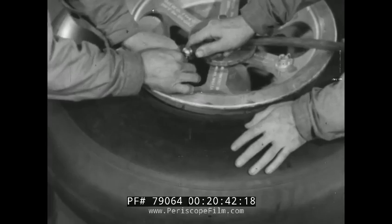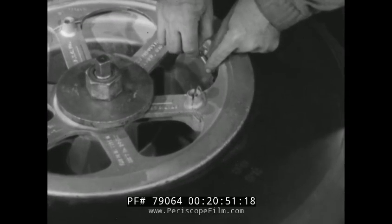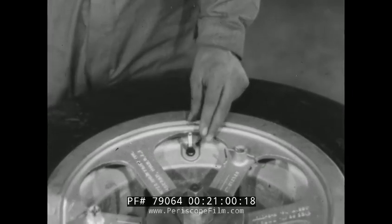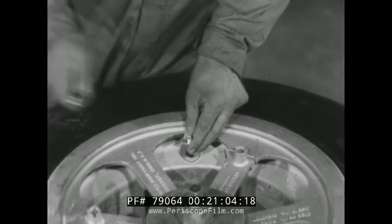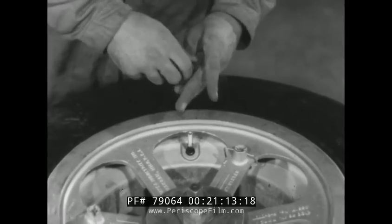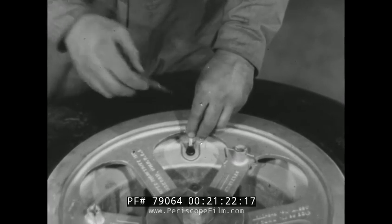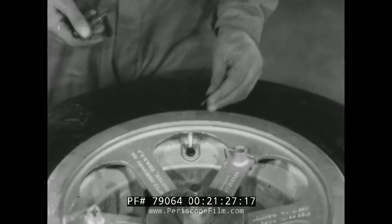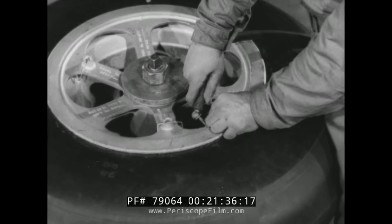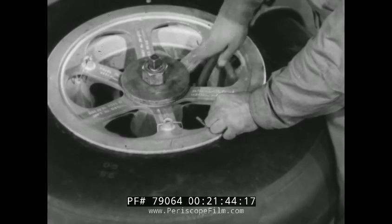With the extension removed, the tire is ready to be inflated. The core housing is unscrewed five turns and the tube is inflated until the beads are seated. Deflate by removing the valve core — this allows the tube to adjust itself in the casing. The tire is now inflated to the desired pressure. After a 30-second wait to allow the pressure to equalize in both air compartments, the core housing is screwed down tight. With the valve core removed, a spit test is made to check for leakage. If no leakage is discovered, the valve core is put back. Because of the tendency of dual seal tubes in nose wheel tires to slip, they must be inflated to the required pressure and kept at this pressure by frequent inflation checks.